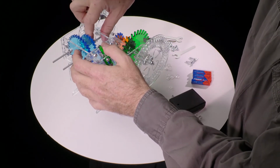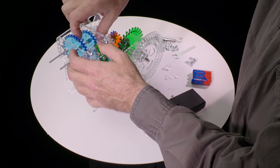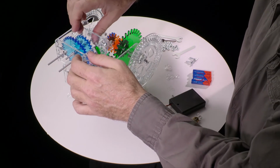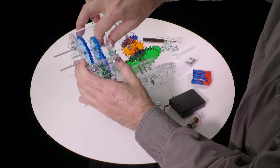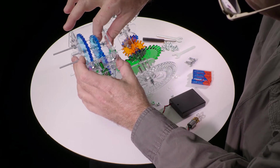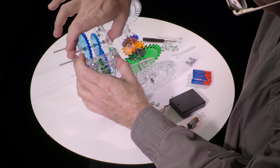And now we can spin all of these back progressively to their final positions. Slide the gears so you get your finger in. They can go farther. Get this one into position first. So it would go to the point where it's tight and this is not wobbling anymore, and then back up maybe almost a whole turn until there is some wobble here. This needs to be nice and loose.